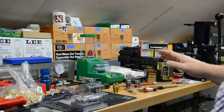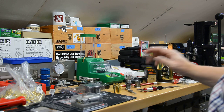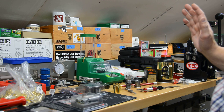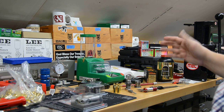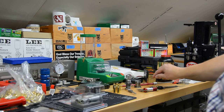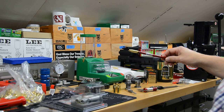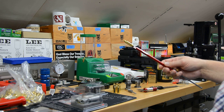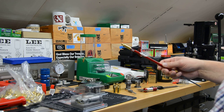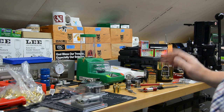That should give us a good starting range. Barnes gives guidance of 2.240 inches overall length and that's what we'll start with. I won't try to push the length yet — I'll wait until we get fire-formed cases and then use our overall length gauge, seat this down in the bore, find out what the measurement is to the lands, and see what our jump is. We'll get an idea of how close we are from maximum magazine length to the lands and do that later.